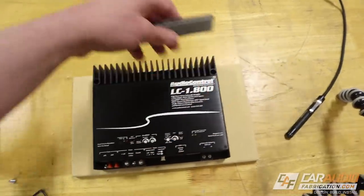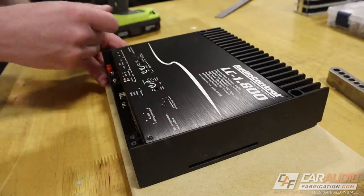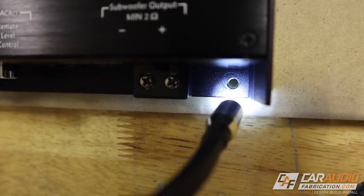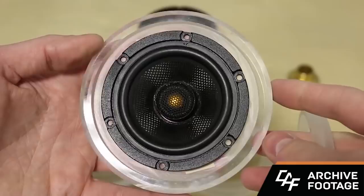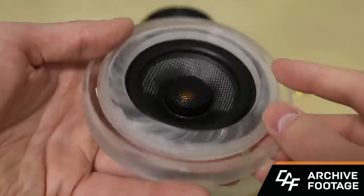With doing that process and using the V drill guide, now all of these mounting holes mount perfectly. I've got three mounted right now and if we take a look at this one and light it up, I haven't put the screw in yet but you can see it's aligned perfectly with the threaded insert. Now I know what some of you guys out there are thinking — 'Mark, I can drill perpendicular to the board no problem, I can keep it at a 90 degree angle.' I thought the same thing, and I've had problems in previous builds where, let's say I'm mounting something like a small three inch mid-range speaker that has six or eight holes. Those holes can be so small and require machine fasteners that are so small that if you even have the slightest imperfection in how you drill and tap your holes, it can be a bigger problem than you think — and it can be easily alleviated with this simple tool.